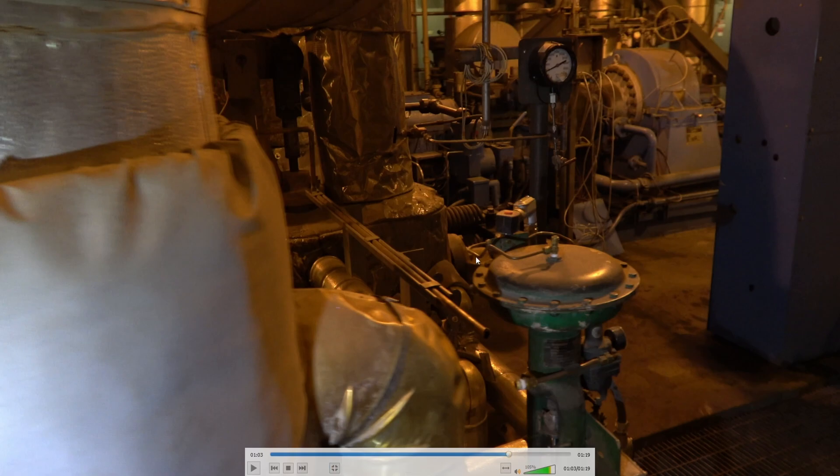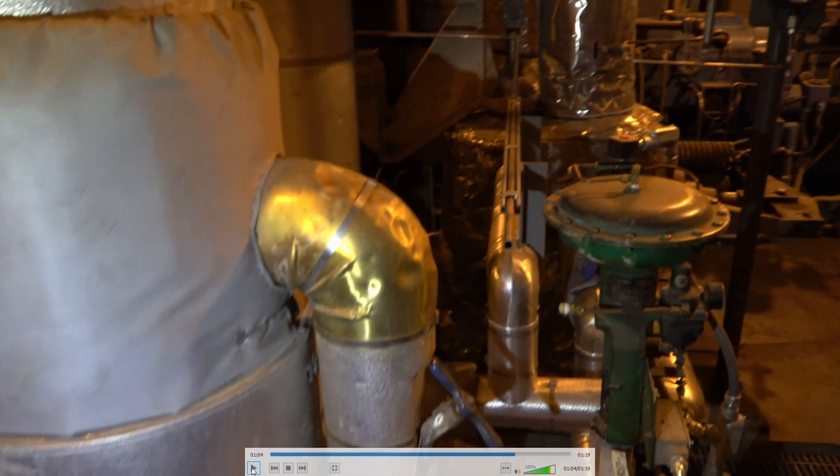You just don't want any water in the steam lines when you start up. Here's your control valve — you have a throttle valve and a trip valve on the high pressure side. The low pressure side has the stop valve and the control rack.